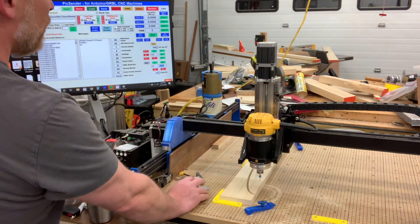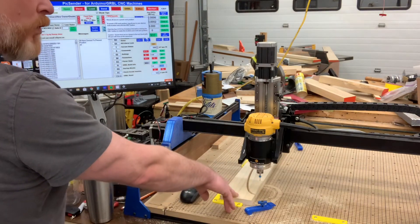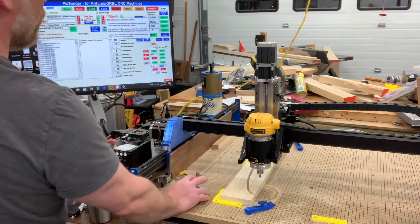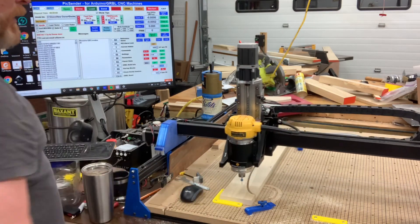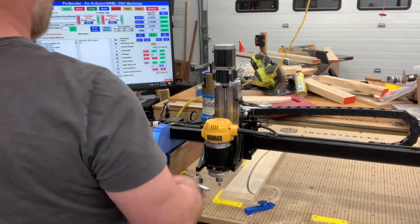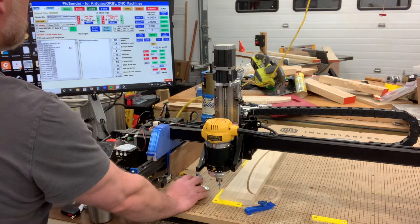When it comes to everything I do on a daily basis — if I'm dealing with three-quarter inch boards all day long — I would set G28 including the Z height, so that every time I put a board in, when I come in the morning and turn the machine on, I hit G28 and boom, it knows everything it's supposed to do. I'm gonna go ahead and cut my stuff, but first the last thing I'll show you is the probe screen.